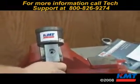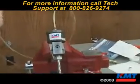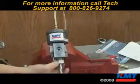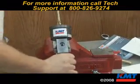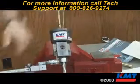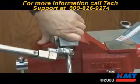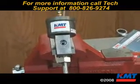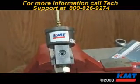Put it back in the vise, and we'll put our air pressure on. Once you apply your air pressure, you should be able to thread that in by hand farther. And with air pressure applied, we want to torque this to 50 foot-pounds. Then you can take your air pressure off.